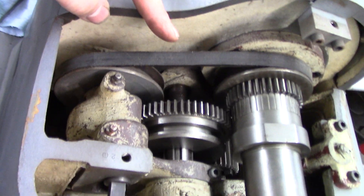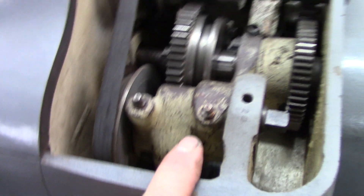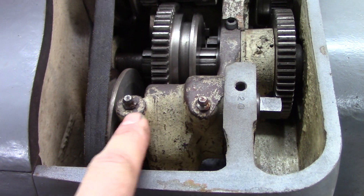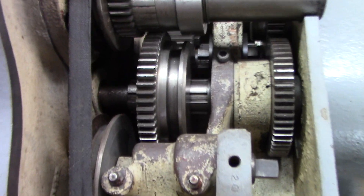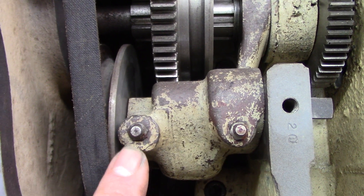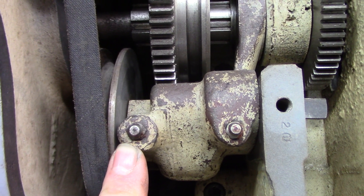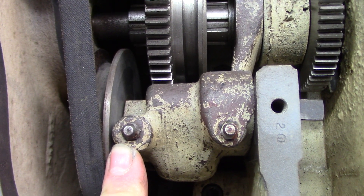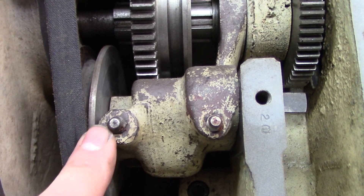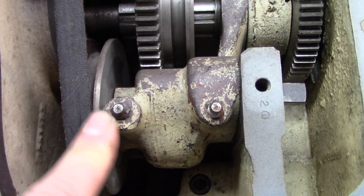There's the belt — it comes off the spindle. There's a little trap door that says grease, so these fittings are grease fittings. Down in there, the bushings — these are bronze bushes. That bush has got some wear on it and it's sloppy. Just running this thing without cutting anything, it gets hot, because there's wear in that bushing and no proper lubrication or bearing surface area.